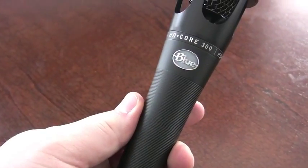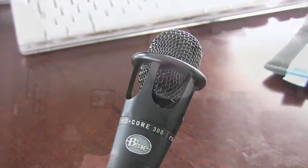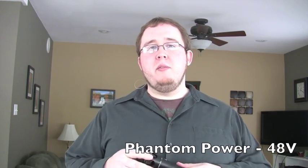Today we're going to be taking an in-depth look at the Blue Microphones Encore 300. It's a professional handheld vocal mic. Something you need to know about this mic: it's a condenser mic as compared to a dynamic mic, which is what most of you are probably used to using for live performance. The most important thing you need to know is that a condenser mic is going to require what's called phantom power — a 48-volt power signal that your mixer or a separate device has to send to the microphone to power it up. Most microphones don't require power, so if you're interested in this mic, just check and make sure first that your mixer does have phantom power. Most modern mixers do, so that's not going to be an issue for most people, but it's something you want to check.